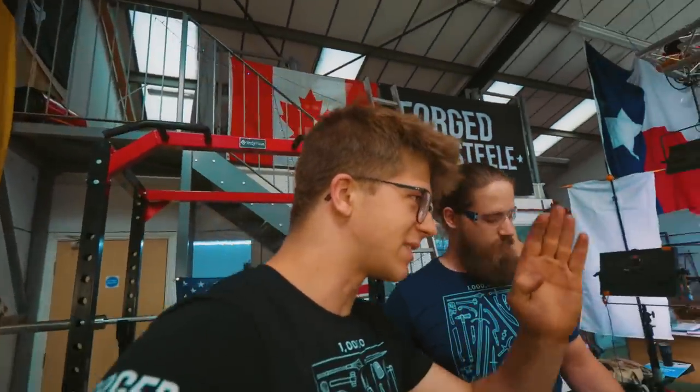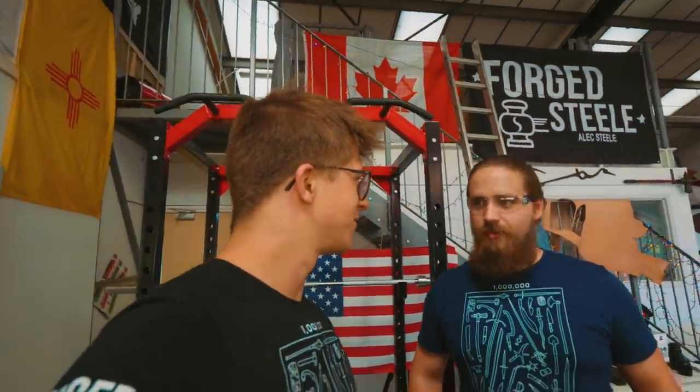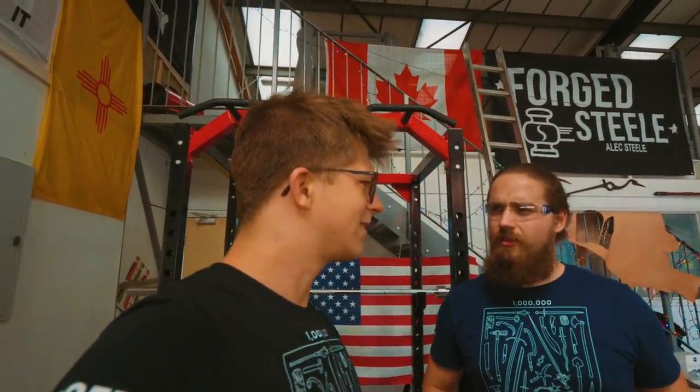It's just longer. From my tiny bit of experience making some of the longer swords, the trick is that you just keep staring down that edge as long as possible, trying to make sure that you keep grinding it straight. It's fun, but it's difficult. It is fun, it's a lot of fun. The chef's knife was a lot of fun. It was about 20 minutes? Didn't take you long at all. I'm actually quite jealous. It took me a lot longer to grind the chef's knife.